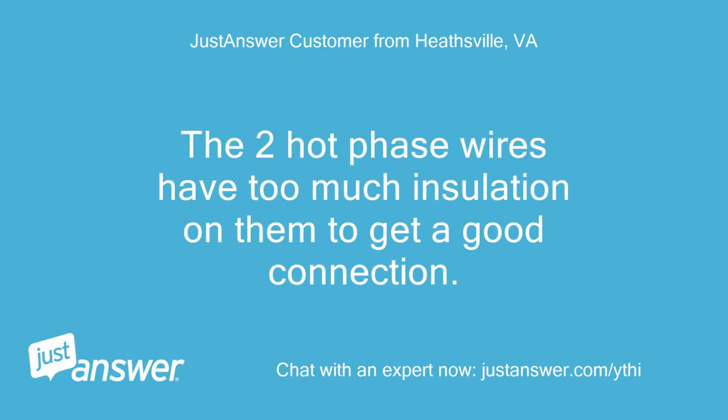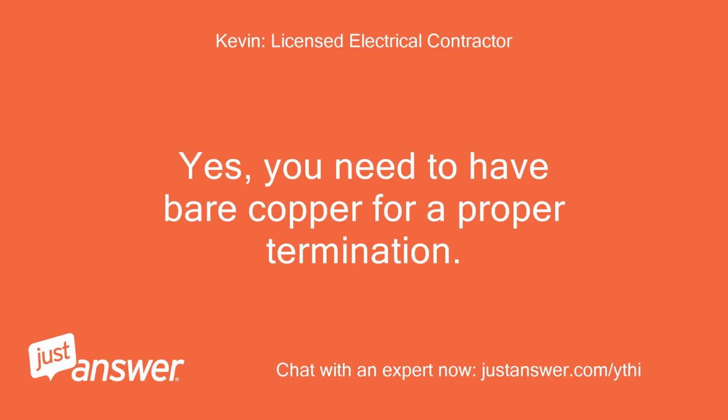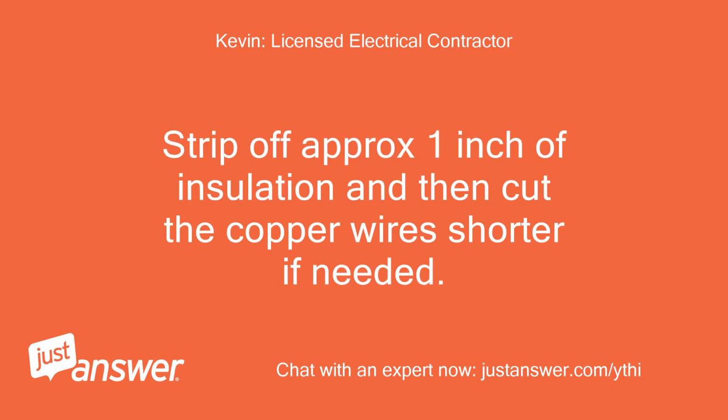The two hot phase wires have too much insulation on them to get a good connection. Should I just clean more insulation off? Yes, you need to have bare copper for a proper termination. Strip off approx 1 inch of insulation and then cut the copper wires shorter if needed.